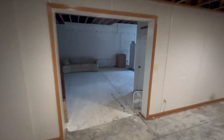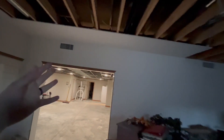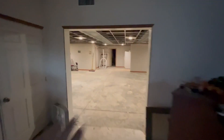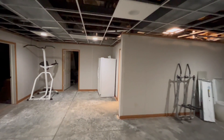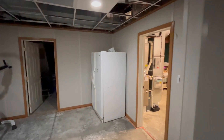In this side room we have nice big 950 diffusers blowing all the air this way. This room was less of a priority than the others but it's still going to heat wonderfully. This is a pretty unique situation — you've got a big basement and an upstairs, and they're going to heat and cool at different rates.